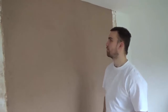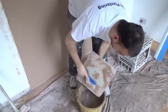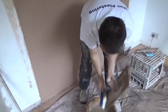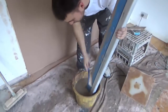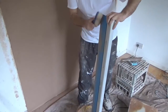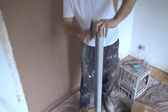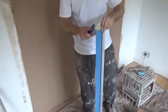Tighten up a wee bit, give it a trial, and give it a key. Right guys, the wall's tightening up a bit now, so it's ready for a trowel very shortly. But get your tools washed up, some clean water, now that you have a chance. Especially want your blade to be clean on the speed skim so it doesn't leave any marks on the wall and stays straight. Clean both sides, unless you don't use that side, but clean it anyway.